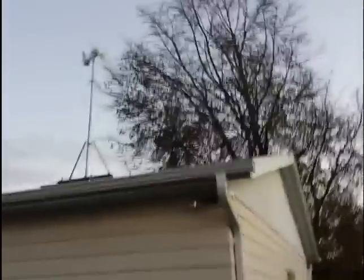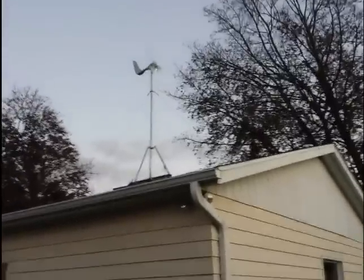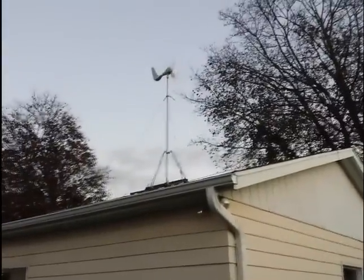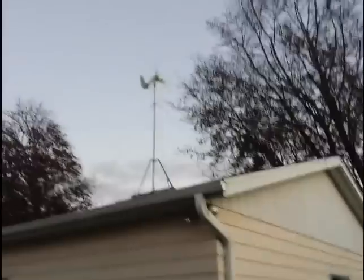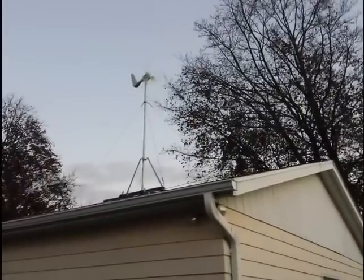Hello. I just wanted to make a video of my wind turbine that I recently installed on the roof of my garage. A couple of things to note right off the bat: I live in the city and that's about as high as they'd let me put it — about 10 feet off the peak of the garage roof. The garage is probably about 13 or 14 feet. The tree next to it is much higher than the wind turbine itself. Per the instruction manual, you're supposed to have the wind turbine mounted about 20 feet higher than its highest surrounding obstacle. So I did not install this wind turbine per the instruction manual because of the city ordinances.